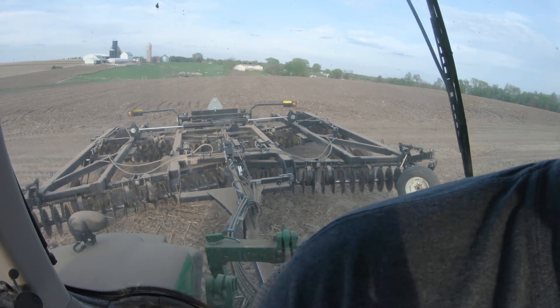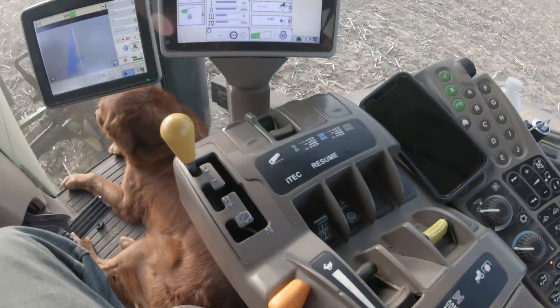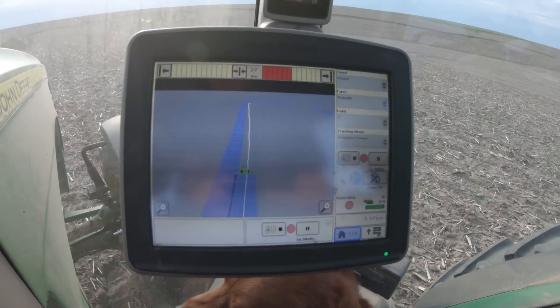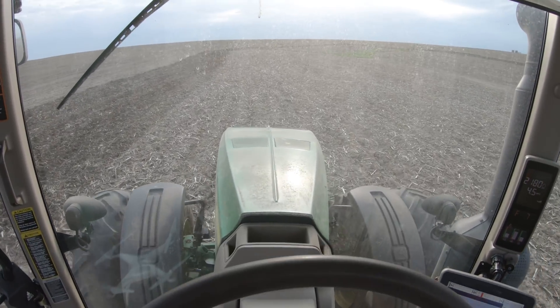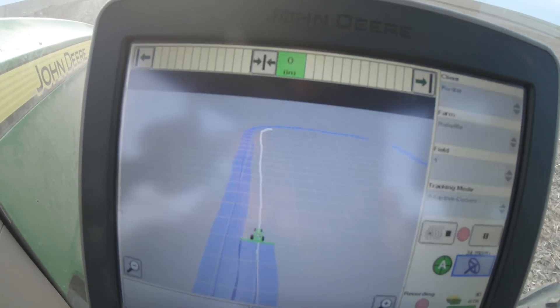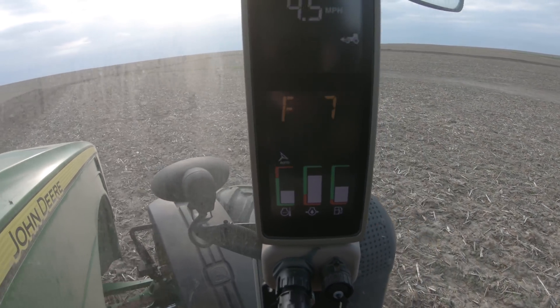To get this all working, all you really have to do is put it in drive, drop it down, and start going forward. Now I'm going to press that auto steer button. The thing you've got to do on this monitor before you get started with auto steer is make sure that your steering is enabled. Now that it's enabled, all I've got to do is hit the auto steer button and the tractor automatically starts correcting. The RTK should mean it keeps it within one inch or so. You can see the auto steer icon on the corner post display confirming it is in auto steer.